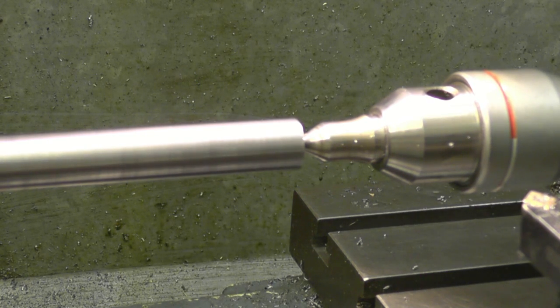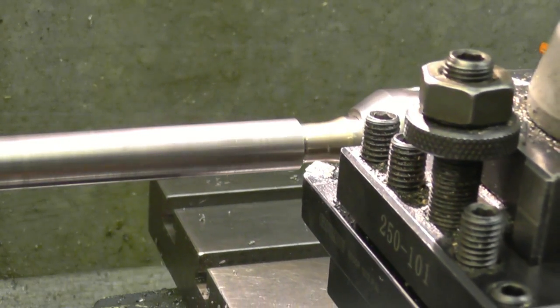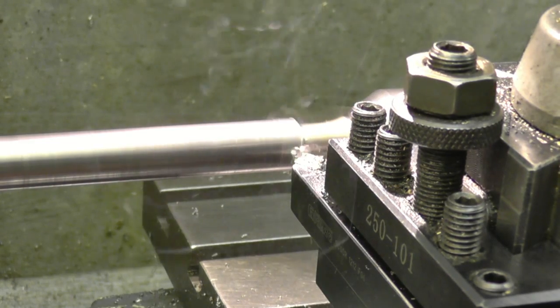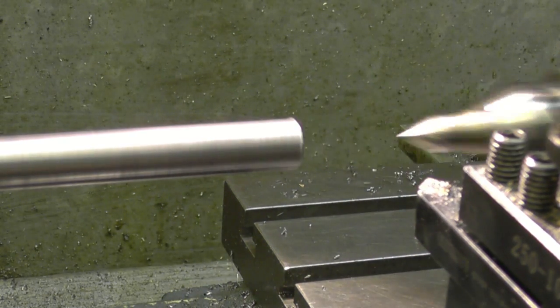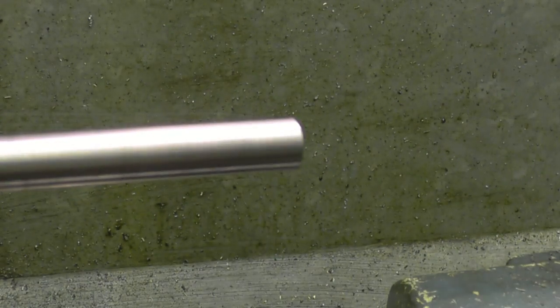All I want to do is break the sharp edge — put the centre in, gently, slow things down a bit. Just use a 45-degree tool to put a nice little chamfer on the end. It always looks better, and it's a lot safer as well — you wouldn't want to put your fingers on it, because if you drop it, it would damage the end of the shaft.